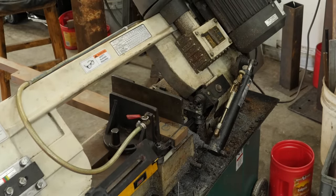The next thing to work on is shaping it all into an actual handle instead of big giant rectangles. The first component I want to shape is the guard — I need to get the top and bottom at least roughed in and then base the rest of the handle profile off of that roughed-in guard shape. I use a combination of the 2x72 grinders and a really large bit on the milling machine. Once I've just roughed the shape in with the mill and the grinder, I can move to files to clean up and fine tune everything.